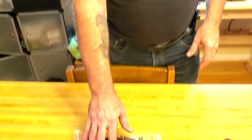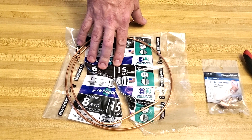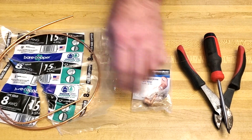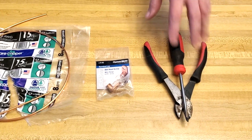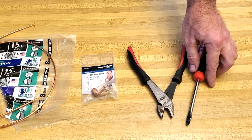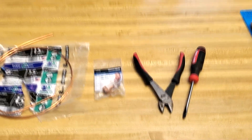Welcome back guys, welcome down to my shack. I got my radio over here as you can see behind me. For this video and for the grounding that I did with my station, I only grabbed a couple little things. I'll show you the basics of what I have up top here. First of all, I've got 15 feet of 8-gauge copper wire for grounding, and I picked up some connectors for the wire which just screw right in. The only other thing you need is maybe a flathead screwdriver and a pair of wire snips. So let's go take a look underneath and see how it all ticks.